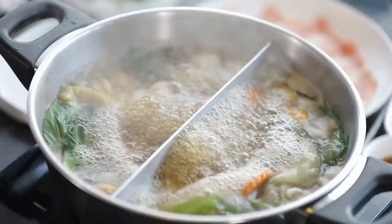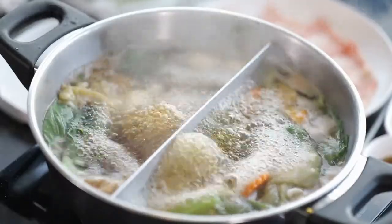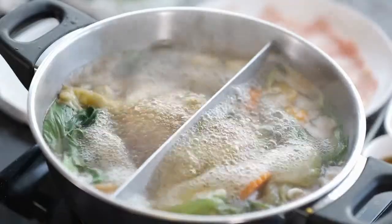On this list, laminate ranks a little bit low on durability. Laminate is not good against heat, so putting hot pans directly on the surface or cutting directly on the surface is not a good idea. However, if cleaned correctly and looked after, then you will likely get 5+ years out of a laminate benchtop.